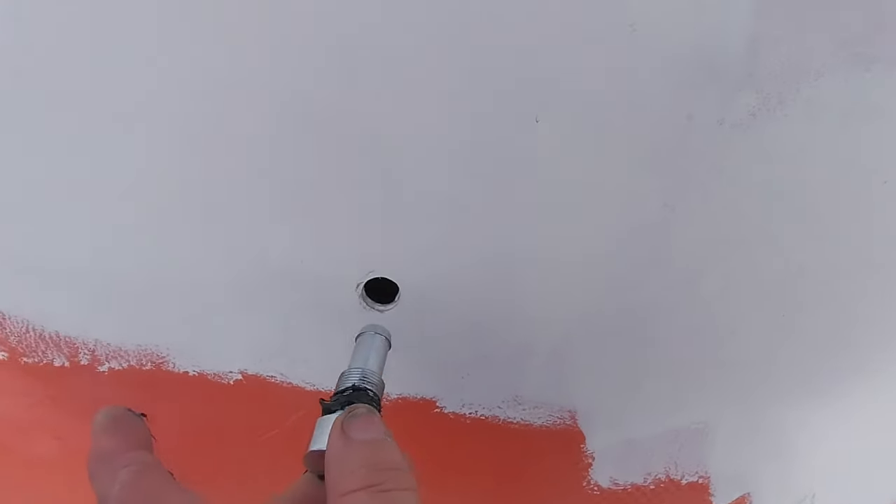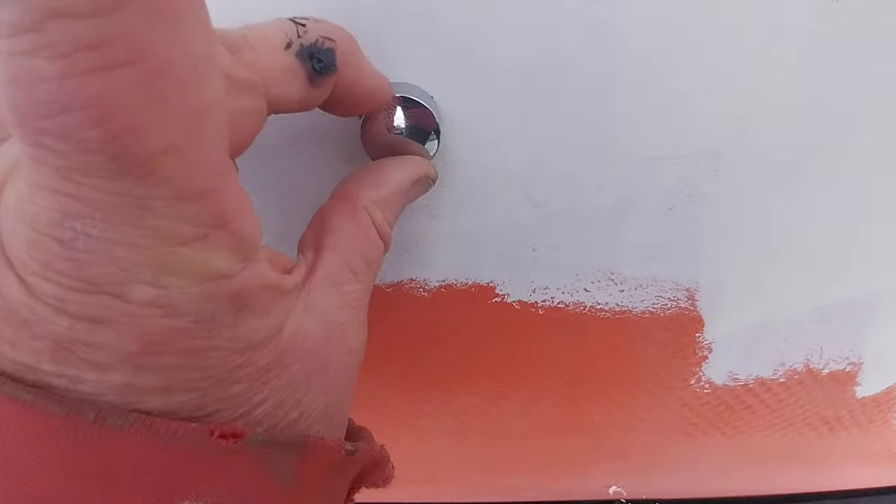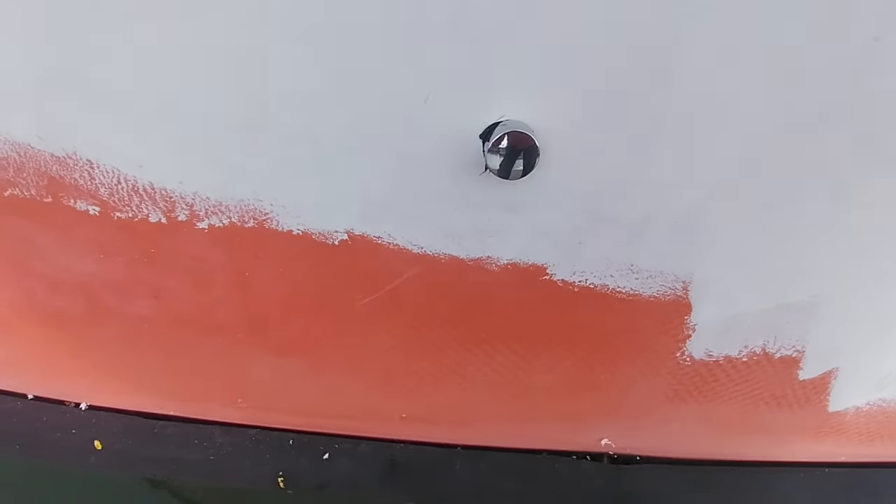Outside again — put some mastic on the breather, that goes in the hole making sure that the holes are underneath so they don't get any rainwater in them, and I'll do the nut up on the inside. It's a bit awkward getting in there to tighten the nut up and I will have to go and check outside to make sure the whole fitting hasn't turned. That will do the job — my vent pipe's already there as you can see.